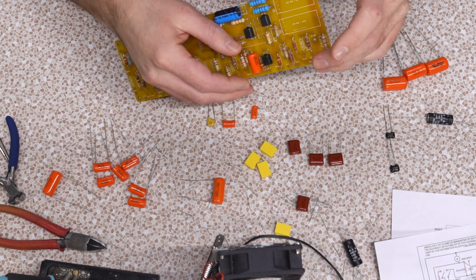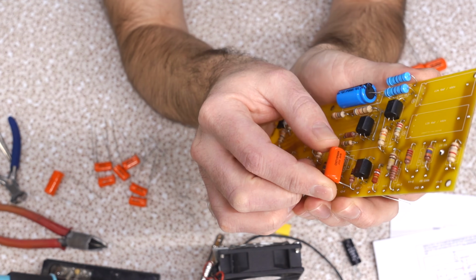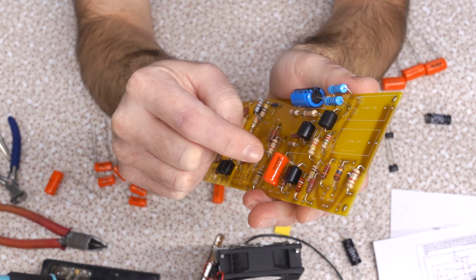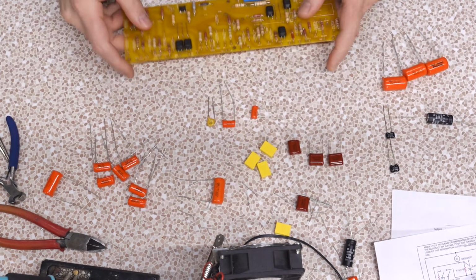No, they mostly line up, except you have a situation where it's gonna bump up against that resistor. So we might have to float them a bit, guaranteed, because there's another little guy that goes in there and it's gonna be too sandwiched. So I guess we'll put the smaller ones in first and see what happens, right?